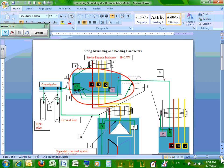Everybody can see. So this is where I bring the power, three-phase power, the neutral, directly to my building. Cool? Everybody's okay with this? Coming from the top, that's how I bring the power from the utility into my building. They call it service entrance equipment. I'm assuming it's 480/277, but it could be any voltage. Cool? So that's the first panel that you have.